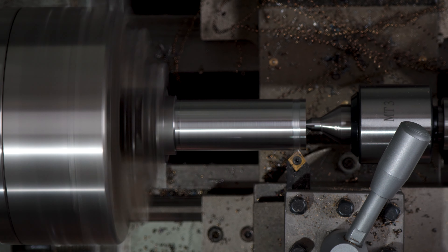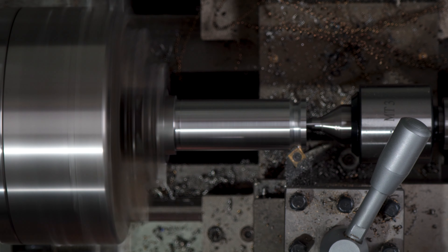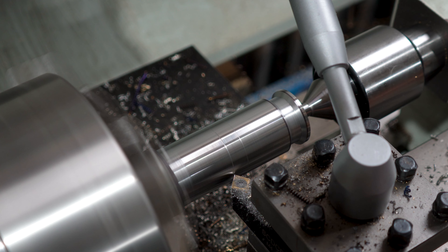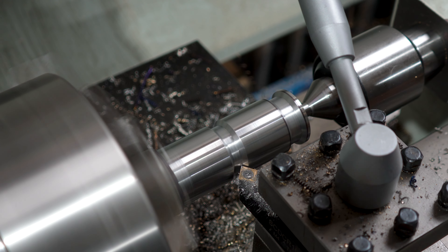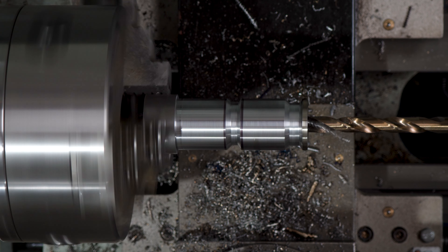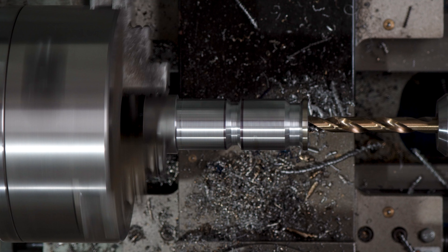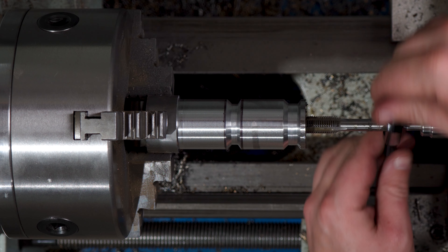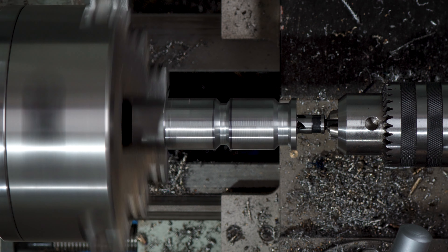As a little note before we get too deep into this project: I'm making two of these little hammers. I thought making two would give me a few different shot options. I'm just flipping between the footage of the two hammers. To give us our cheeks, I'll make two little channels about 6mm or a quarter of an inch deep, and about 10mm or three-eighths of an inch wide at the top of the cut. To get the brass face attached, I'll pre-drill a hole and tap it to M12. Good thing I have this nifty little tap follower I made in the last video — it really does a good job of keeping the tap nice and straight. Then a quick lead-in chamfer and I can pop this blank out of the chuck and get to work on the brass.